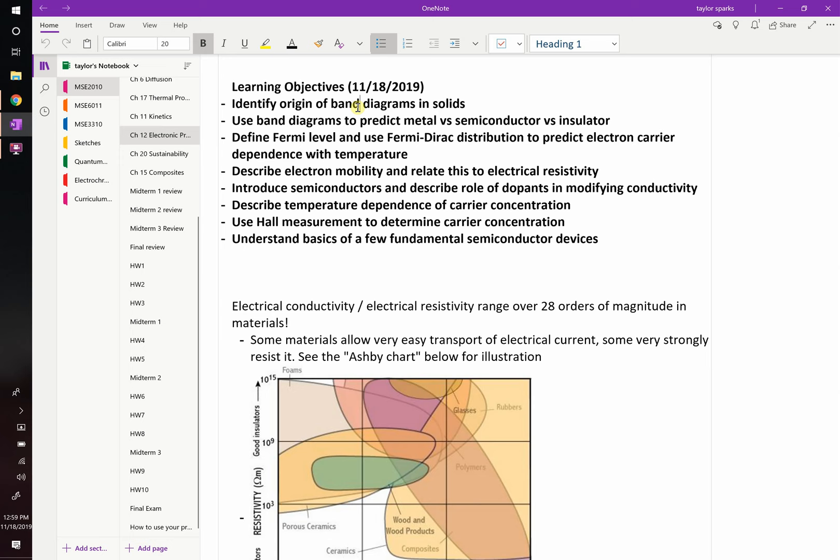What's really cool about these is that they can also operate in reverse. I can take this device, set it on this table — the table's colder than my hand. If I put my hand on one side, there is now a temperature gradient across this device. If you touched a voltmeter to these two wires, you'd see it's actually generating a voltage. I made a tiny little battery out of the waste heat coming off my body between the table and my body. You can either generate a temperature gradient — make one side hot or cold — or you can generate a small power source.